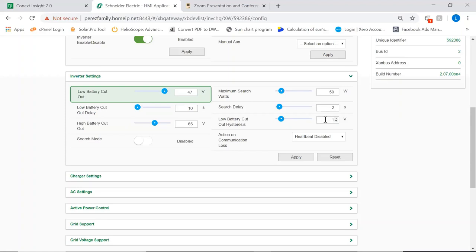You get up to 1.5 maybe, but it doesn't suffer from the big voltage drops that typically a lead acid battery has. As well, if you were doing this application with a lead acid battery, you would not be good using 1 as hysteresis. You would want to use 2, for example, or higher, depending on how old the batteries are.